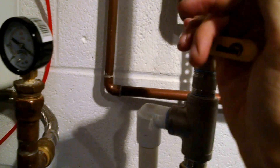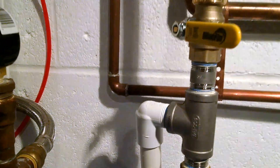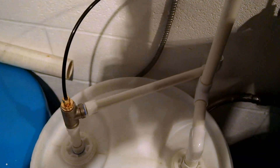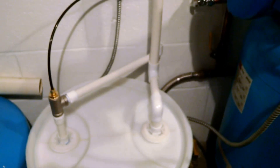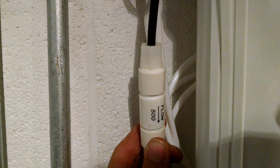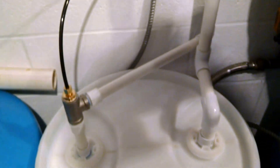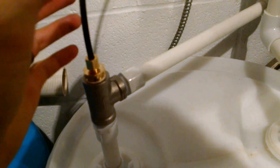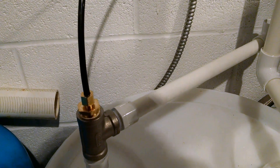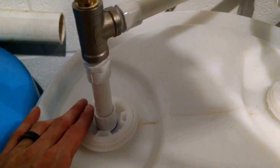I have an isolation valve here — in this case I have it turned off because right now I'm actually taking my suction water from this other line, which is this barrel, which is the drain — the wastage that comes out of the rejection side of the membrane. About 60–70% of all the water that goes up against this membrane gets rejected. It ends up coming out this black line, goes through this flow restrictor, and goes down as waste. You can just drain that off and get rid of it. But in this case, because I'm dealing with rainwater, all this water that comes through this black tube has been filtered through all the sediment filters and the carbon filter and everything else, but it hasn't gone through the membrane, so it just gets collected right back into this barrel.